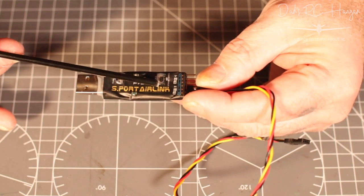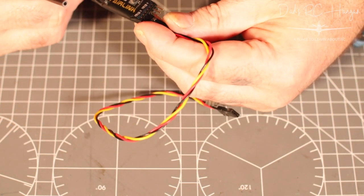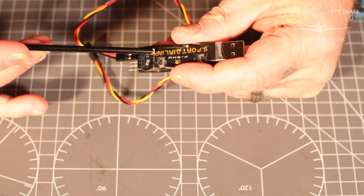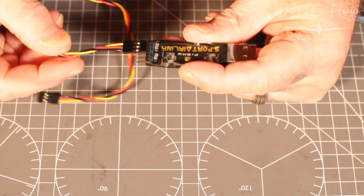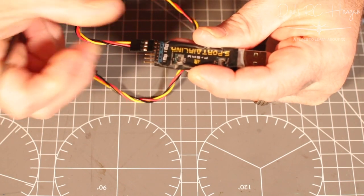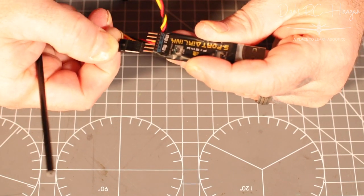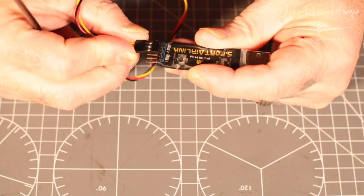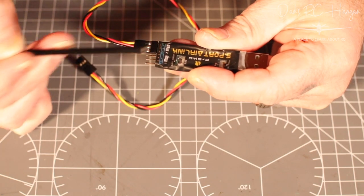So you've got two dip switches here. Let's put my goggles on. Here we go. One that's at the bottom here says upgrade and config. So you switch it either way. If you're in upgrade, you put the fly lead on the opposite side. Just to make note, if you use the config, you flip it, because it's that way round. I nearly made a mistake of just swapping it over and blowing the thing up. So it does say on there what's your minus and plus, negative and positive, and signal cable.